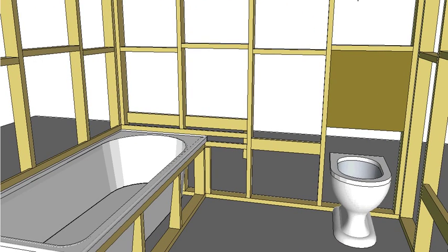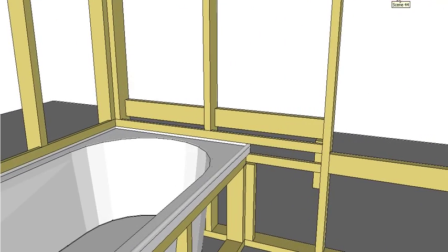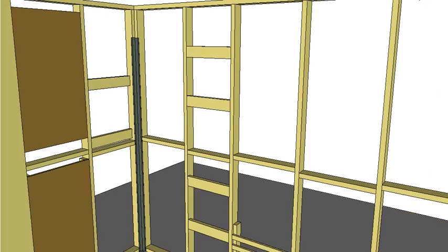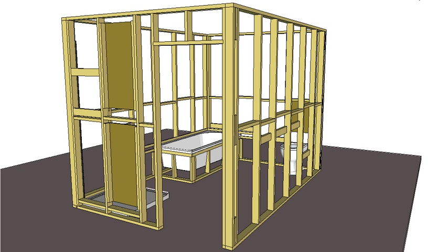Then the other ones — commonly the carpenter doesn't necessarily install these, but they need to be done — are for your taps. The plumber would generally install these as he goes. But you could have a couple of noggins behind the bath, or even down this side nowadays, for the bath taps. Up in this corner with the shower, you're going to need a noggin for the shower rose and again a noggin somewhere for your taps to be mounted to, but the plumber may generally do those as he goes. So there is our bathroom fully kitted out — it looks a bit busier now because we've thrown in a heap of noggins and we're ready to sheet our bathroom.